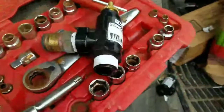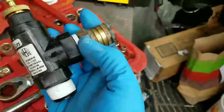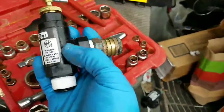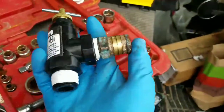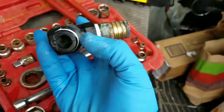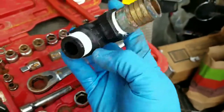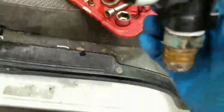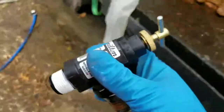This is tightened there, but it's not overly tightened. That's a big thing, guys — you can easily split one of these by tightening it too much. Again, this is the weak point in this entire system. This won't be quite as big of an issue. I don't think I've ever broken the inner fitting when twisting something into it. Usually it's going to be the fitting that's going into it — it's usually the female, not the male portion that breaks.